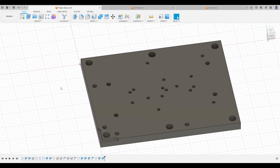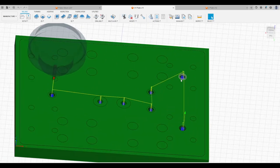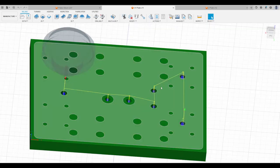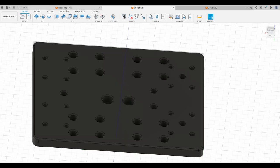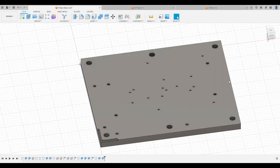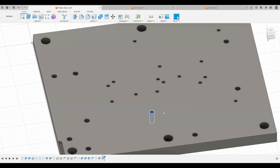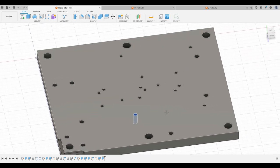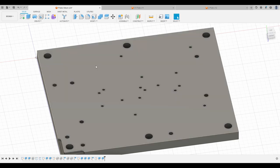After that, the same thing also gets done to the XY plate, by the way. We do a face and we do a bore, and you can see we have the locating features and some through holes in order to bolt the plate down. And all the miscellaneous small holes you can see around here are 4.2mm holes that are meant for M5 tapping. So as I said, I can bolt stuff down.